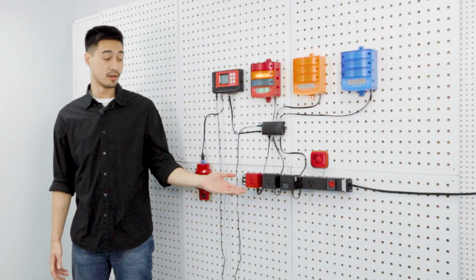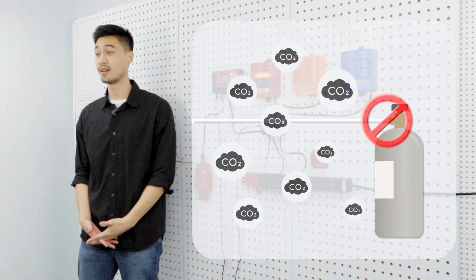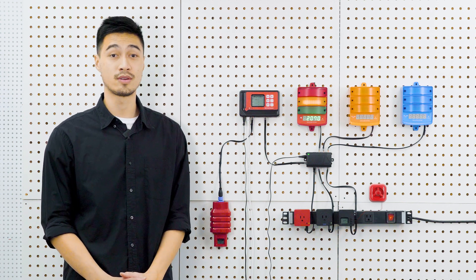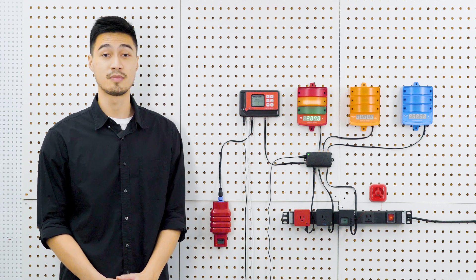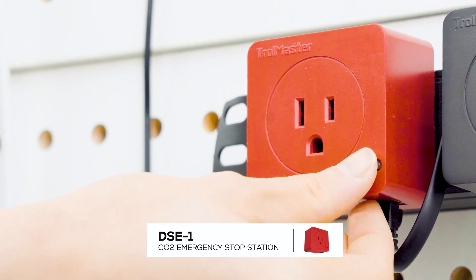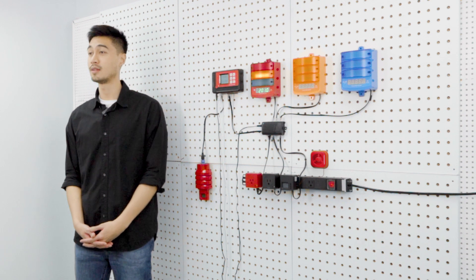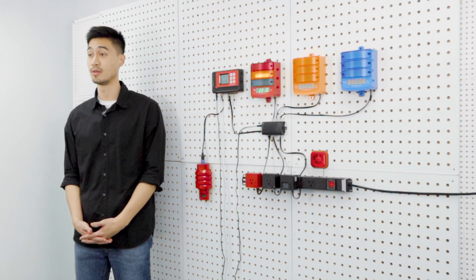Using the DSE-1 emergency shut-off module is a simple way to instantly shut off the CO2 supply when a high level of CO2 is detected. Most regulations will require incorporating an electrical shut-off within your system to instantly shut off the flow of CO2 gas when a CO2 level of over 5,000 ppm is detected. The DSE-1 is a 120-volt emergency stop station designed to stack on top of your current CO2 controller's device modules. It will then act as a redundant CO2 control device to shut off CO2 if there is a CO2 controller failure.